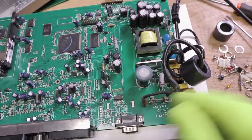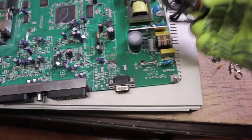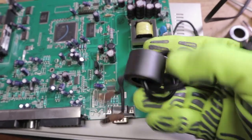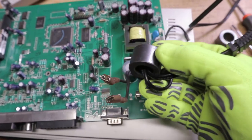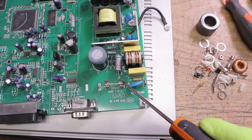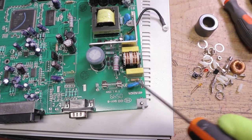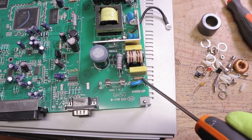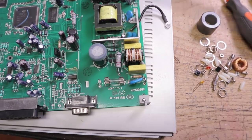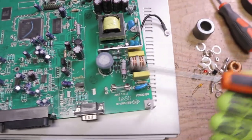We can start from where the power cord comes in. The power cord is turned around a toroidal ferrite to dampen high-frequency noise coming back from the internal circuit — this is a useful part to keep. From here, a fuse carries the power to this metal oxide varistor, which protects the following circuit from possible voltage surges from the power line, such as those caused by EMP generated by lightning. You can see my previous video about EMP to learn more — link in the overlay and description.